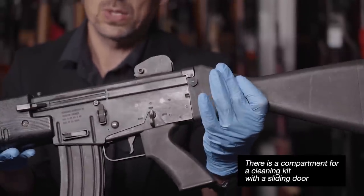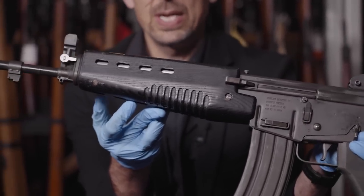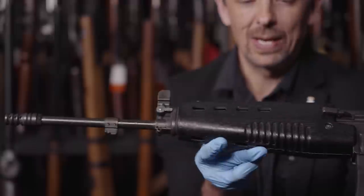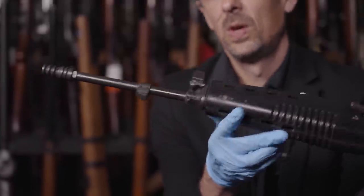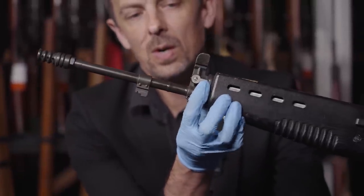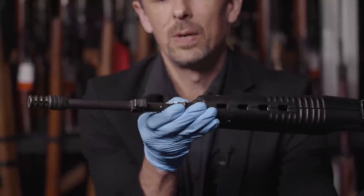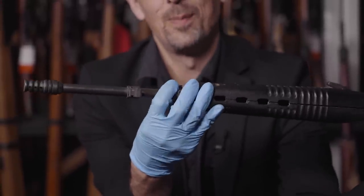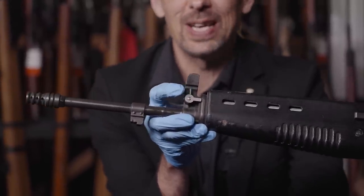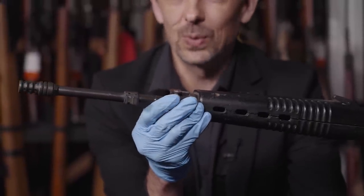The furniture is not standardised on any of these. The front handguard is two pieces of wood — it does have a heat shield fitted to it, so it's not quite as rudimentary as it looks, but clearly at this era the final handguard would have been made of polymer. We've got an adjustable gas block up the front here, and a simple circlip keeps it in place. It's marked zero, one, and two — zero for gas off for launching grenades, one for normal operation, two for adverse operation in dirty or difficult conditions.